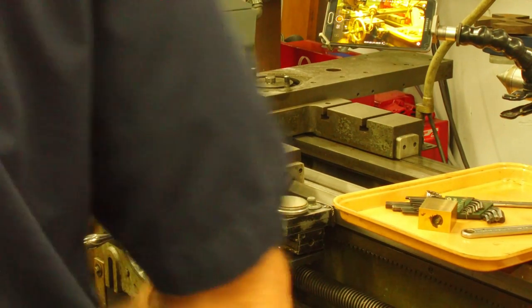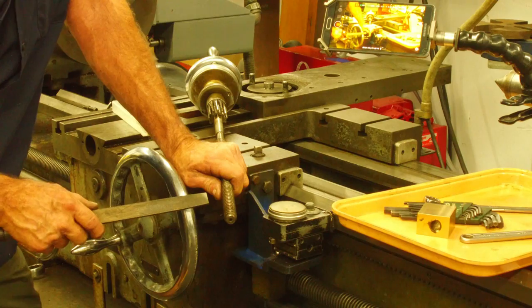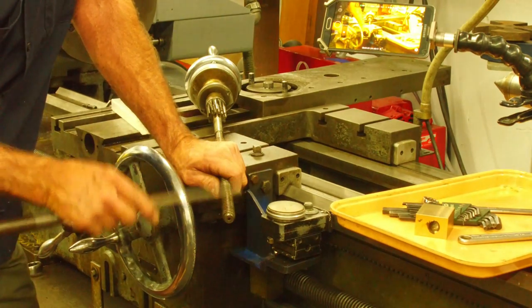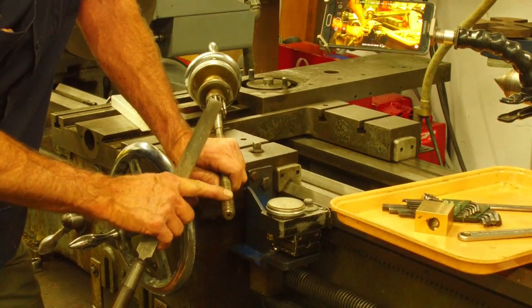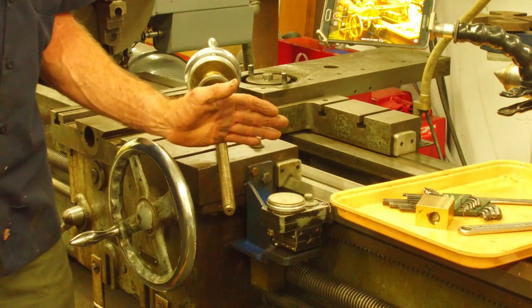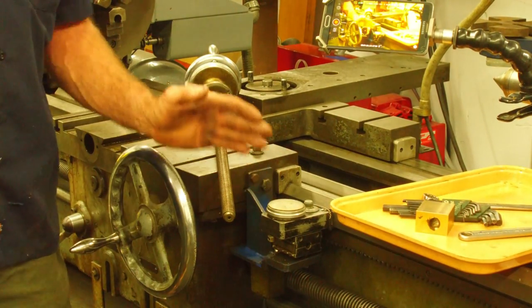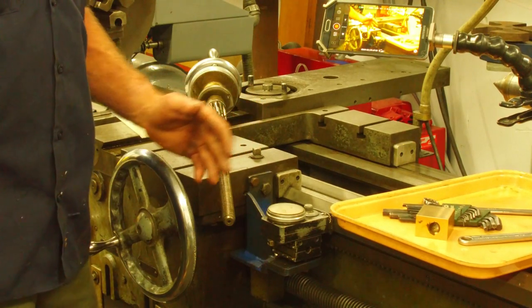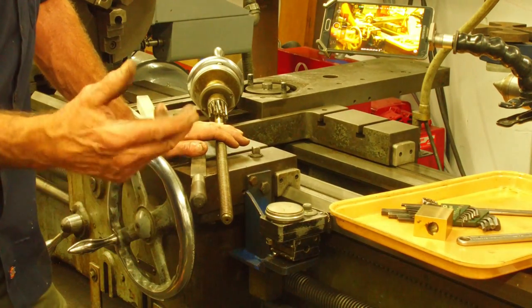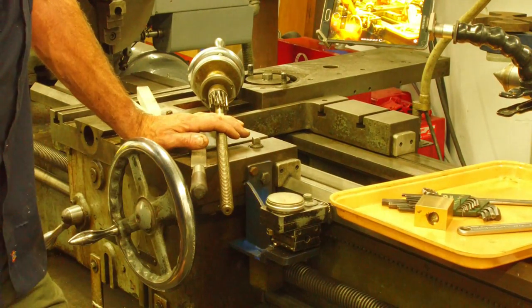I'm just looking at one, you know, junk file. Okay, we can file it. This is not hard. Now we don't know if there's a rolled over edge here, whatever, but we do know that that nut is tight at the beginning of our thread, which is less used than in the middle somewhere. Where you've commonly used the lead screw is going to have the most wear, out at each extent, just like on a mill, on a Bridgeport or a K&T. All the way at the extreme travels is going to have a tighter nut screw combination or contact than when it's in the middle where it's worn most of its life.